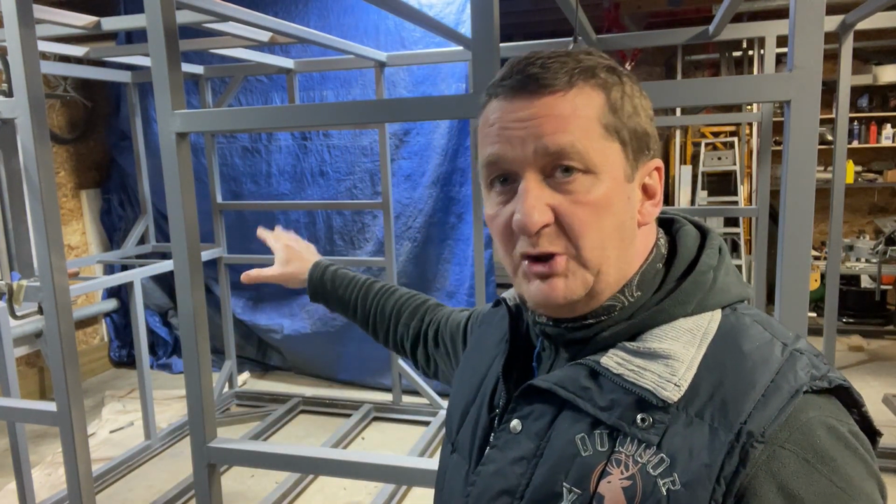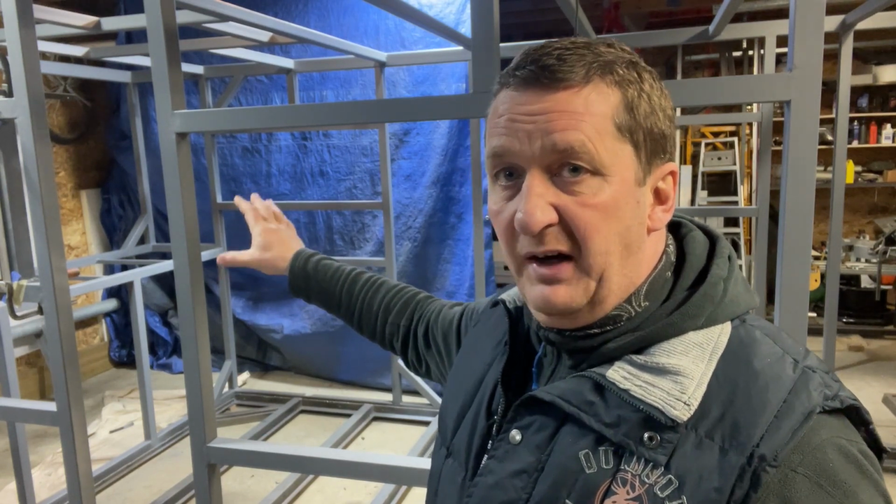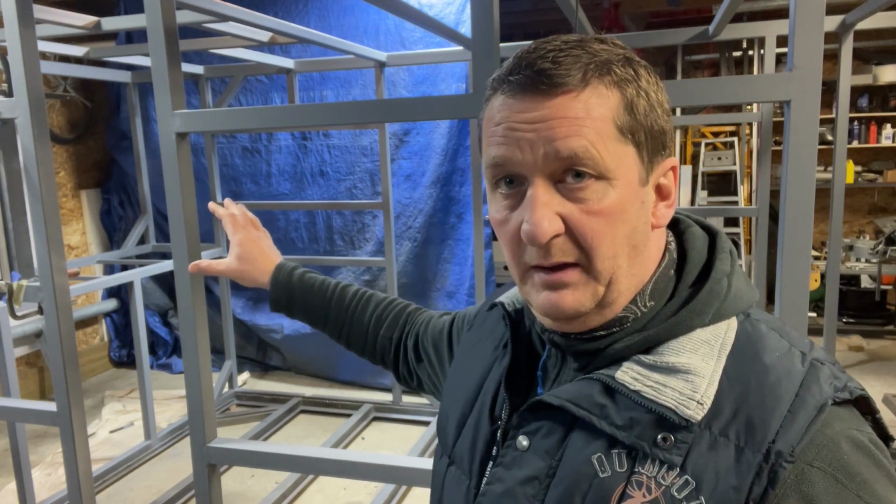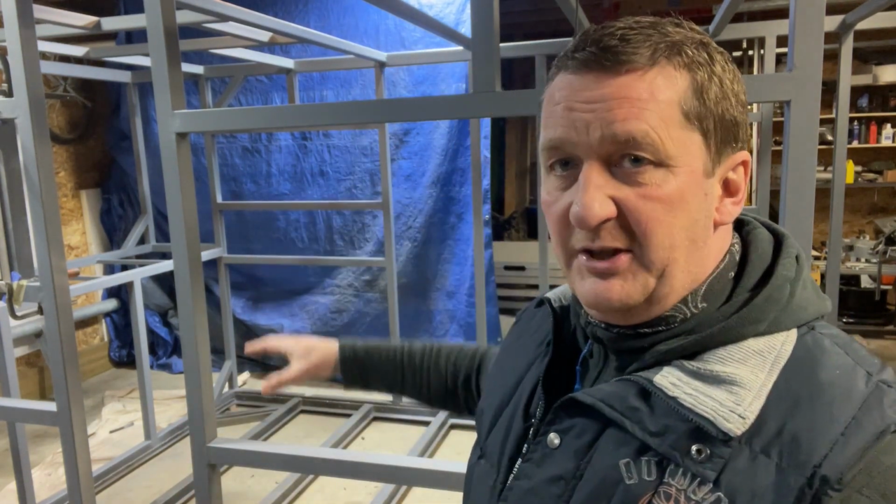Okay, so that is, let's say, 50 to 60 millimeters, or 2 inches to 2 3/8 thickness. Mine would change, because I have 75 mil insulation, so in the end I have almost 100 millimeter wall thickness, almost 4 inches. But it's a little too early, because I'm talking about insulation in the upcoming videos, so just leave it at that. In Canadian dollars, 160 to 200 euro equals 230 to 288 Canadian dollars for a 50 to 60 millimeter wall.